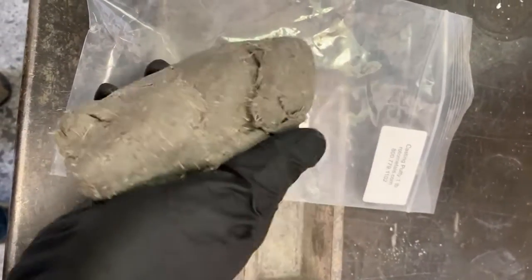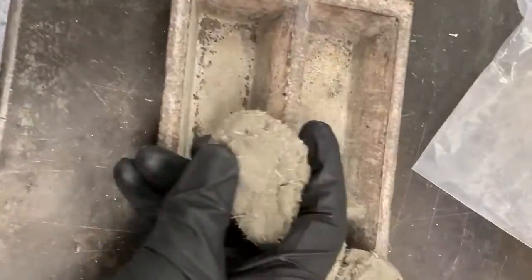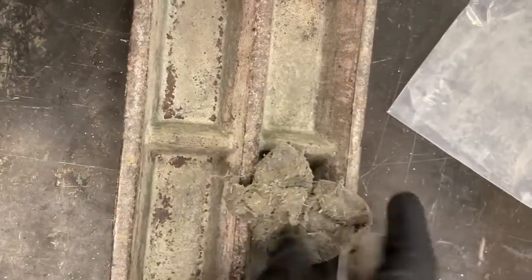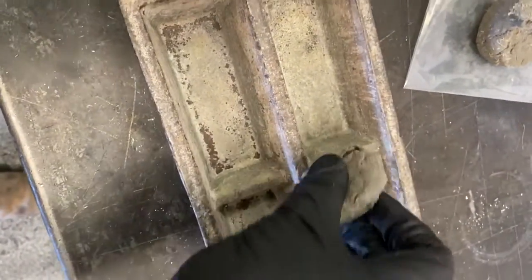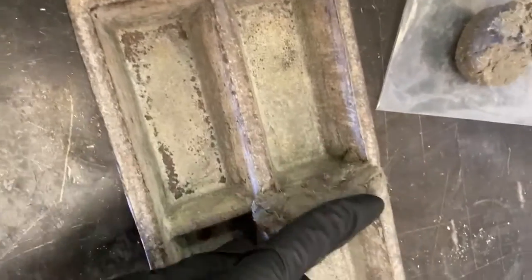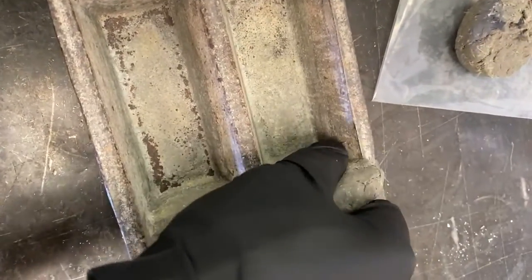We also have it in a 5, 10, and 50 pound option. It's kind of like horse manure, but it's got very good high temp use in foundries for mold repair — if you had a crack or something, or you need to do a temporary dam because you want to do a pour for a single one-time use.